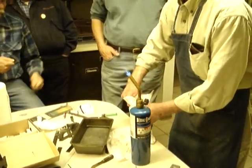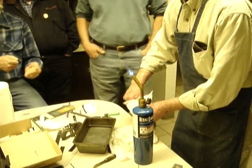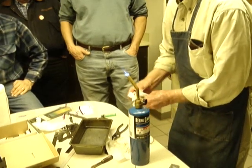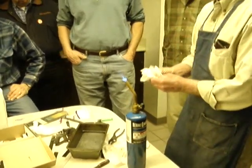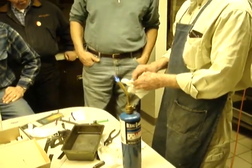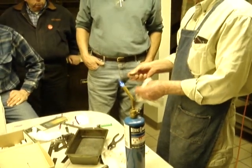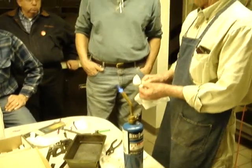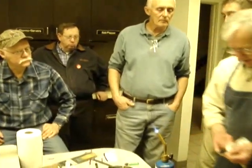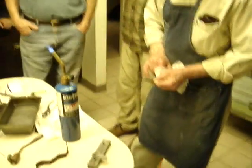That's why when you're grinding them, if you burn it just a little bit, it doesn't matter. Because you bring it right back to that color again. Well, you can create soft spots if you grind it and say you bring it to purple or bluish purple, you might end up with a soft spot in the blade. But you can tell by the color. Yes, you can. If you're grinding it and you're getting to this color back here, you're probably taking a lot of temper out of the blade. Pass that around.